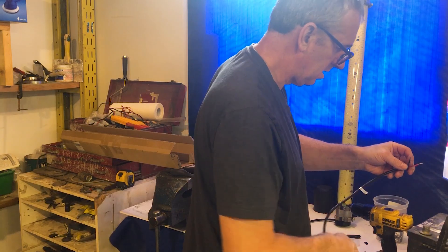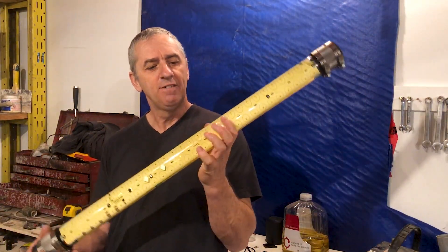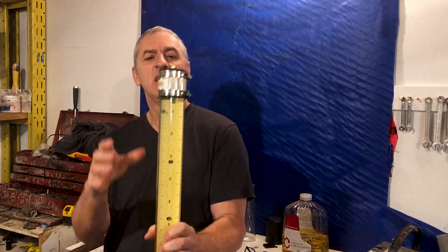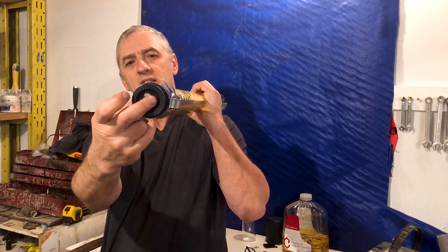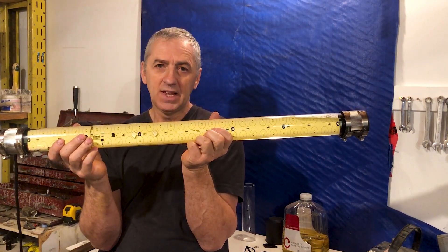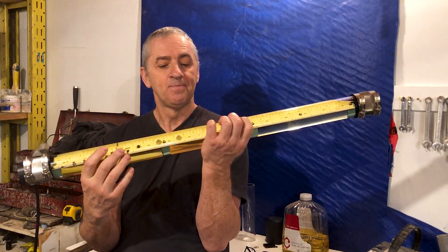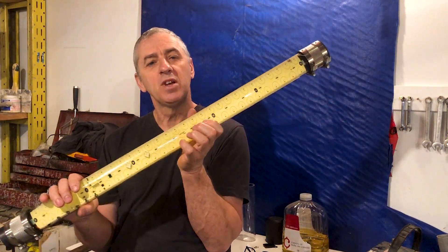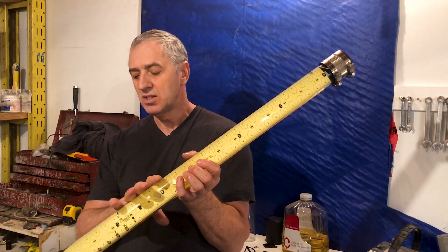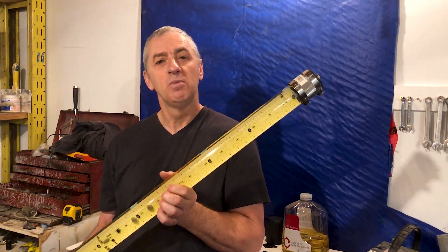Give it a little test — and it works great. Just to recap: this is the light we just built. I filled it with vegetable oil, two inch acrylic clear tube, two inch cast iron pipe connectors, homemade plastic ends — there are a lot of ways you can do that — quarter inch pipe plug for filling, electrical cord, and epoxy sealed. I have never had a problem with one of these lights. They are super reliable, 24,000 lumens, and plenty bright. I've had this on my submarine to 300 feet repeatedly and even 500 feet in an unmanned test. They're suited for a submarine or an ROV because they're very neutral — the oil makes it very neutral, and all the components are very lightweight in water. This light will go 3,000 feet without any concern. I hope you enjoyed this video — we're making many more. Ciao.